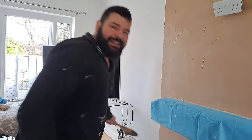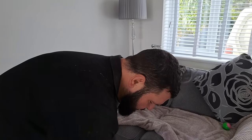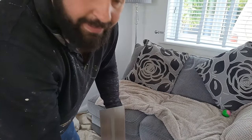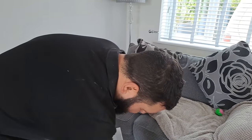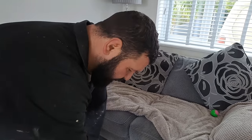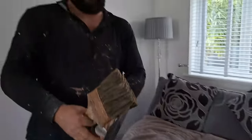If the SBR had dried out from the day before or something, you wouldn't get that. But because we've got the SBR about 20 minutes to dry, you still get a little bit of background suction and a little bit of reaction. Anyway, all I was going to tell you was don't worry about it. I know loads of fellas, when they're starting out, see a few bubbles and start panicking, but there's nothing to worry about just yet.